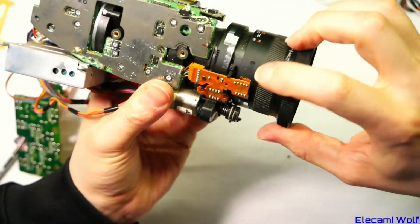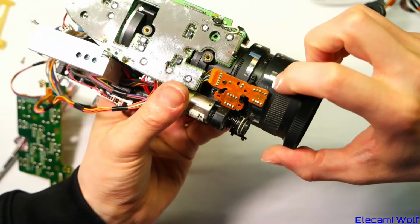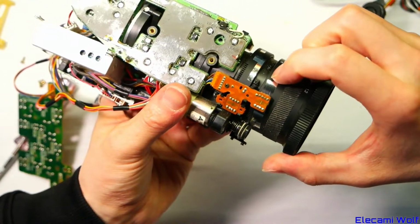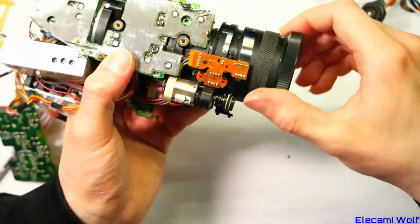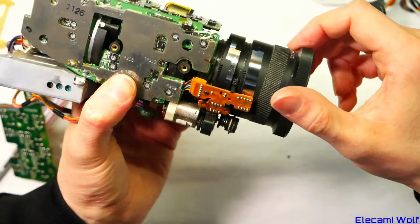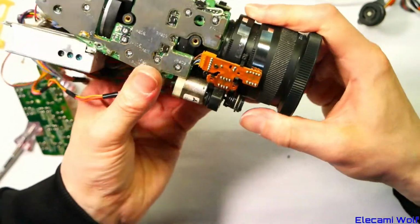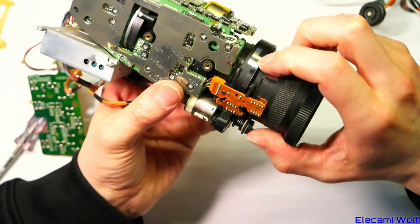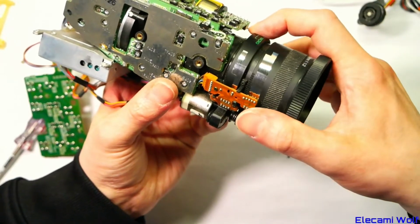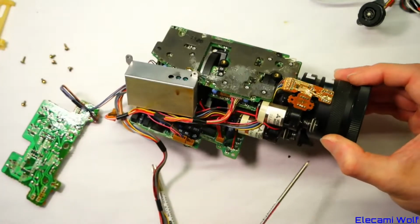Okay, so that can tell when it reaches the extents, because two sensors, and that will change from only that one lit and not that one to the opposite at the other end, so it can monitor the extents of the focus. And then similar for the zoom, although it only seems to know roughly where it's in the center in that case, because those edges are longer. It's a bit more involved than that, it seems.